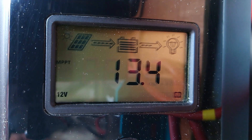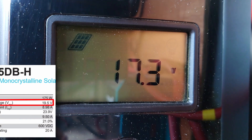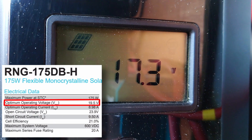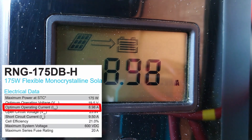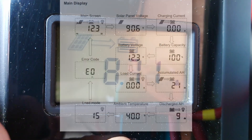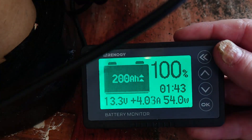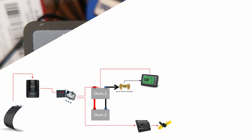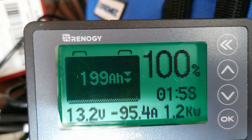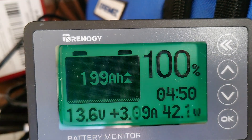Having taken that decision, we can use the controller to monitor what's going on. The controller has a lot of information to look at. Here we can see the solar panel voltage, which today is showing a healthy 17.3 volts — the optimum operating voltage is 19.5, and it's not a clear blue sky today. On the current side, we're doing even better than expected, with 8.98 amps being the optimum here. We can look at battery capacity and voltage too, but those parameters are better viewed on the battery monitor, which measures the whole system using a current shunt. Using the various monitors, we can keep an eye on battery condition, and if you keep a log of what's going on, you should easily be able to see if something's not right. If everything looks healthy, it probably is.